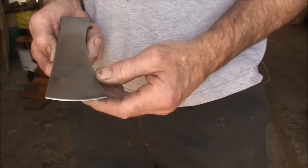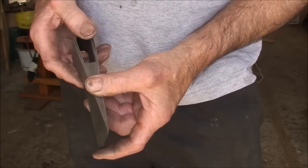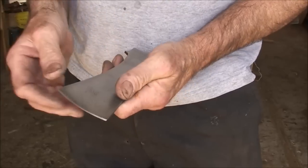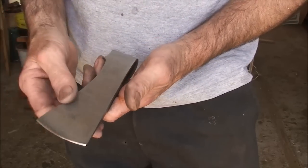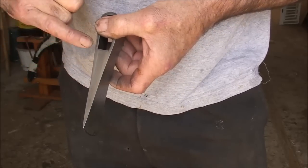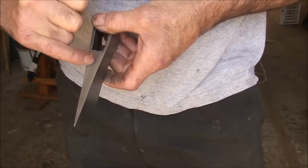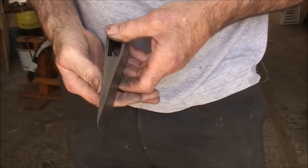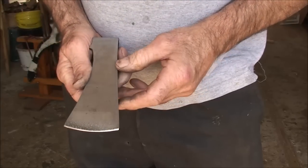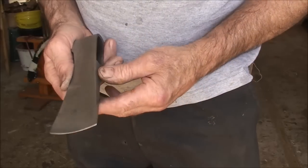I've tempered the blade back a bit because as it comes out of the forge and has been treated, it's way too hard, it's very brittle. So I've given it some heat, and I've tempered it back, so the Rockwell will probably be around 55 on it now. You can see the layers now in this. You can see the layers of steel, the mild that formed the eye, and the spring steel down the centre, and then two layers of carbon steel in that. You see that again there, and you can just see some patination in the spring steel there where it just comes through.